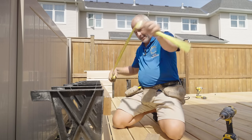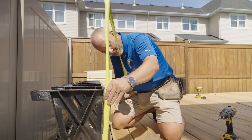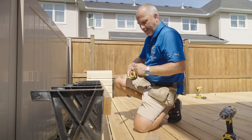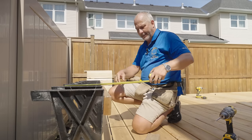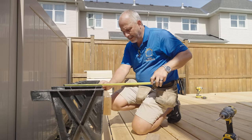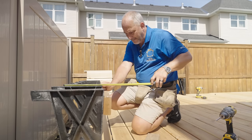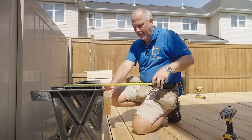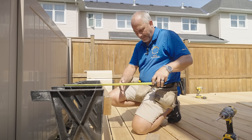Now, the height of this, it's easier to measure off, 13 and 3 quarters. Okay, and we wanted an 18 bench. That's 10 and a quarter. That's 7 3/4. But I want it on the finish. I'm gonna go 17 so that the cushions are over top of the finished wood.